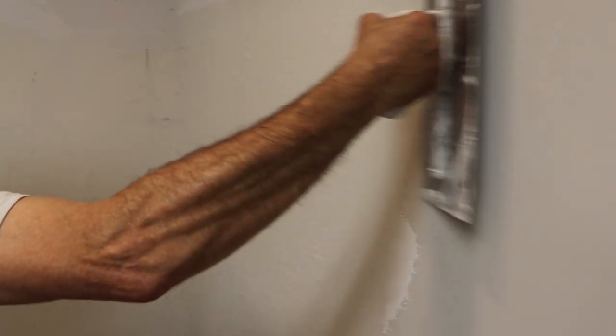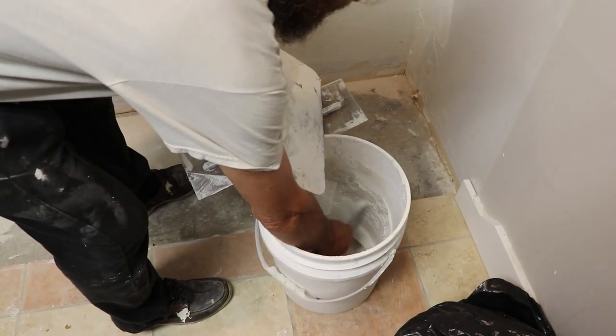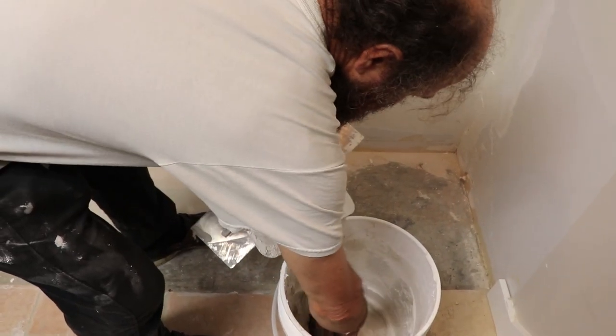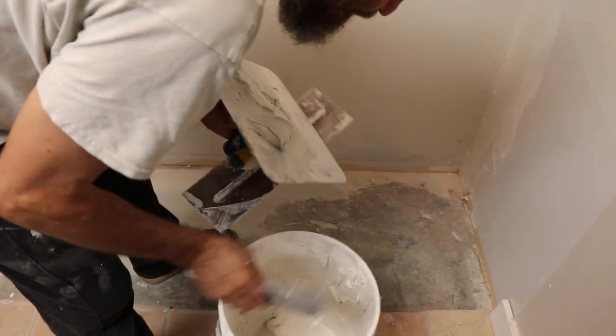I'm just gonna load — and even though we have a lot of mud, we're just gonna clean it up smooth. Just to show you — if you have something like that, just run the trowel, it should remove pretty much everything. Our surface is way flat now. You can see the difference from this one that I put an extra coat, versus this side that just has one coat. In this case we mixed a little bit more than what we need for the first coat, so I'm just gonna use it — gonna load one more coat. That way it looks better and I would use less mud.